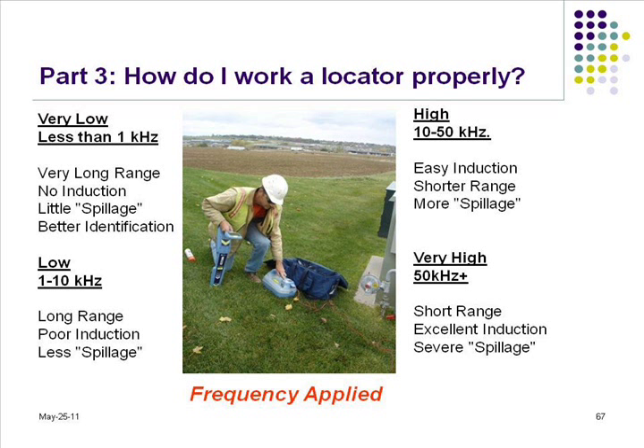So if you have a garden hose or an extension cable or Christmas lights, when you're putting them out and get them caught on something, instead of walking over and untangling it, you try to wiggle it loose — if you do a nice big single burst, you'll see it go further than if you do three or four bursts all in a row; they'll only go about half the distance. So that 512 hertz frequency will go much further than an 8 kilohertz, or even a 29 kilohertz or 33.